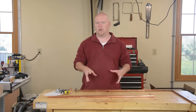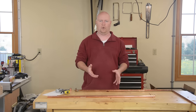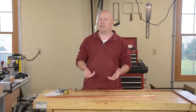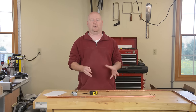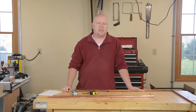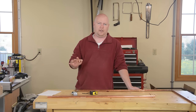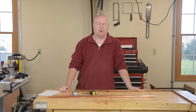There are only two things you need to know to plug into one of these calculators. One is the frequency that you want the antenna to be optimal for, and the other is what's called the velocity factor of the material you're making the antenna from. The velocity factor sounds complicated but it's really nothing more than what percentage of the theoretical speed of light does electricity travel in your material. Copper is a really good conductor, so the default of 0.96 works pretty well.